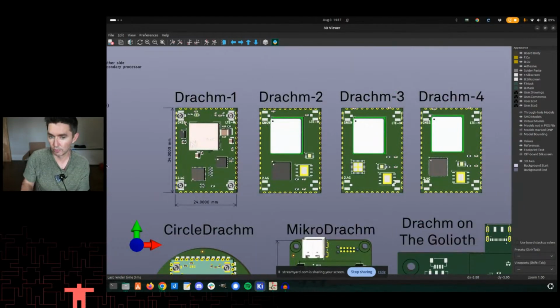And then you can also do things like targeting different regions. If you don't know, a lot of cell modules are region specific, and you can get a lower cost one that's not a global one. So you could have a lower BOM cost by having one that targets North America, one that targets the Asia Pacific region, APAC, and one that targets the EU region. And you can lower your BOM costs by building in your own modularity in that way.